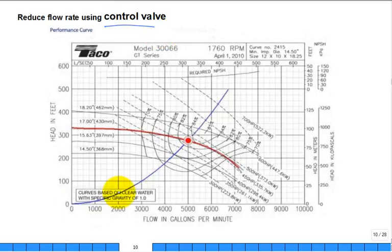Well, let's take this as our operating curve right here. This is our operating point, or system curve. That's our operating point in our pump. Let's say I wanted to close it from 5,000 GPM to 4,000 GPM. Just reduce the flow by 20%, right? Well, I'm going to have to put another curve that goes through zero, has the same shape, but has a greater loss, that K has been added by closing a valve in addition to the other Ks,